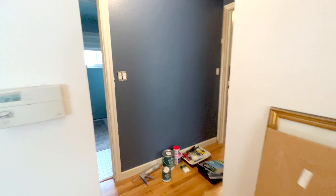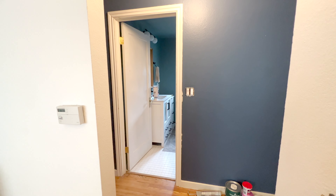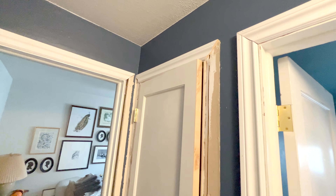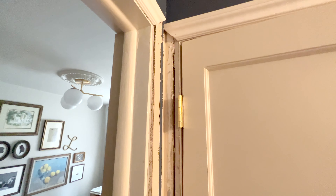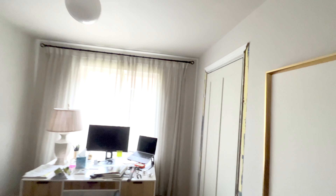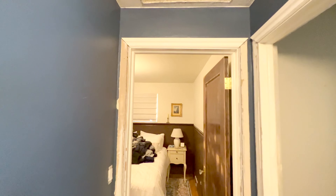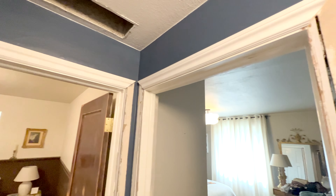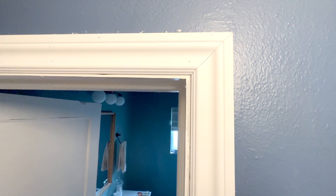It's the next day and per usual I have made my house a mess in pursuit of beauty and perfection. I'm so excited about the trim work on the bathroom door — it's the most visible and it is so beautiful. I got the tops put up for most of the others, including the linen closet, including this funky little cut I had to do in the corner. I'm going to need to borrow my in-laws' table saw to make the cut on the narrow trim piece. The best route is to measure, cut, and install the top portion first because the sides are much easier to cut, and generally you want the sides to be just millimeters off the floor. You just match it up with the top — and you don't want to cut the mitered side, just cut the flat side on the bottom.